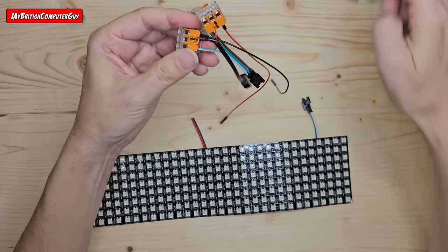Okay, one thing I didn't do, I do need to let it know how many LEDs are in this particular matrix. So we're going to go back to the LED preferences. Both of the other boards had 256, so that wasn't affecting anything. But this one only has 8x8, so 64. Save. Oh wow, it got a whole lot brighter all of a sudden. Okay.